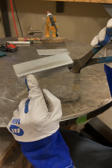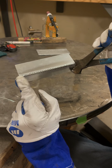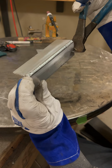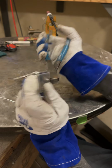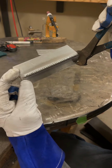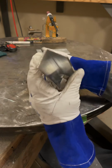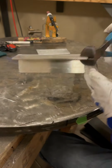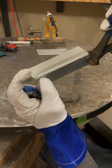So at about the last inch, I'm already tapering off the gas pedal because this is melting like I'm running at higher amperage. And if you can see, like this end, I pushed a little bit more filler. There's not much of a crater, a little bit, but you can tell just by the profile how wide this is getting that it started to melt through, and we see some evidence of it right here, and that was not from the tack, but it started melting through a little bit more there. And that's because it started heating up.